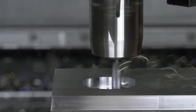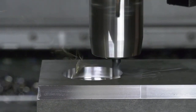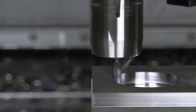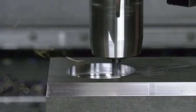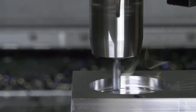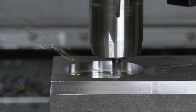This is the Whisper Cut four-flute. As we've seen from the operations we've already carried out, it's an extremely rigid tool. So it can be applied in heavy roughing, light roughing, slotting up to two times D, pocketing, plunging — which we've already seen — and ramping, which we'll see in the next operation. These are available in square shoulder, ball nose, and radius options from 15 thou up to 250 thou, in different lengths of cut and diameters from an eighth of an inch up to an inch. If you can't find what you're looking for in the standard offer, we can always use our customized solutions and advanced engineers to make the tool you need for your application.